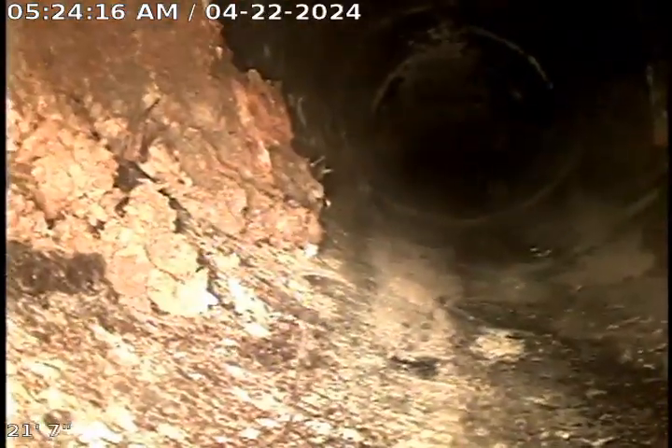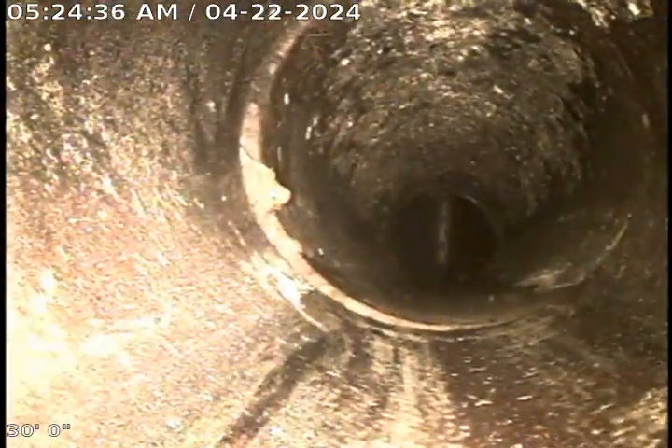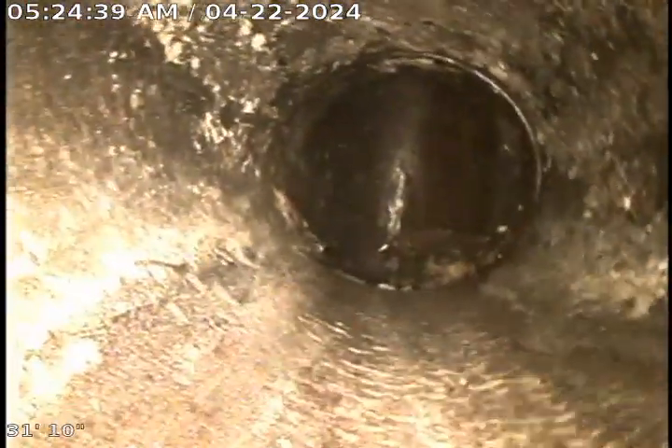Transition from the new PVC 4-inch to 6-inch clay right at the foundation. Here is a yard trap outside. I guess we'll have to move out there and go through that part separate. That was the 6-inch clay from the basement clean-out to the trap.